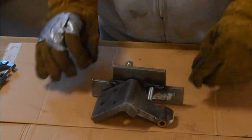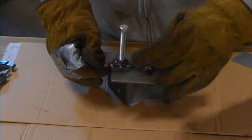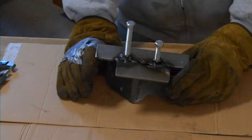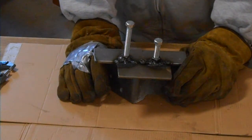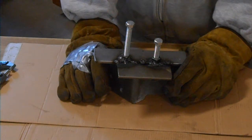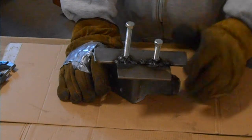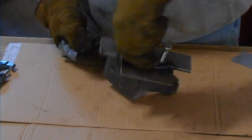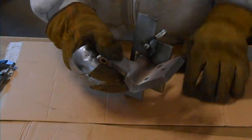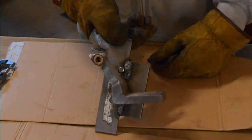A couple of things that we learned when we were doing this. The welds on top, joining these 2 plates together, are really terrible, and that was because we used bare wire and shielding gas, which is really made for sheet metal, and we turned it up to the recommended settings for 1/4-inch steel, but it didn't really work as nicely. We switched the welder over to the flux core wire, which doesn't require any shielding gas because it's already got the flux in the wire. And the welds on the back, you can see we did those with the flux core, and those are beautiful.